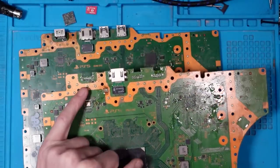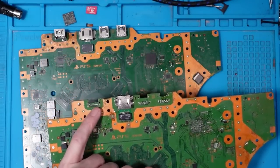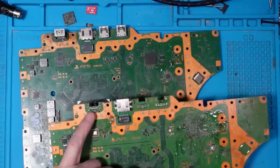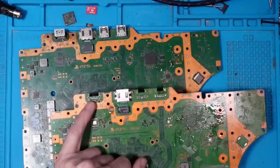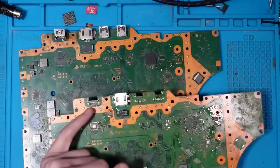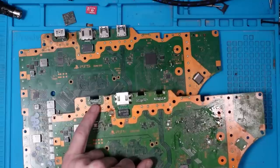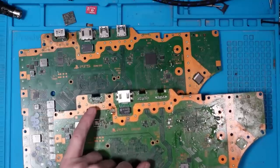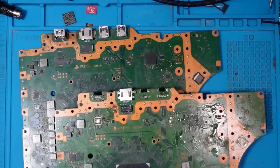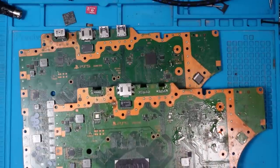On this donor board here you can see the normal HDMI header. The problem with the HDMI header is that on the back the pins are exposed. Even the slightest bit of impact will knock the HDMI port and unfortunately that will knock the pins clean off the board. Sometimes you'll get a flickering display, sometimes no display at all, and sometimes it won't even be recognised by the television.